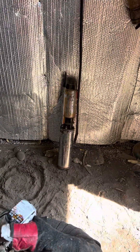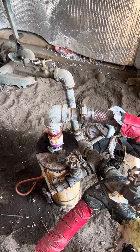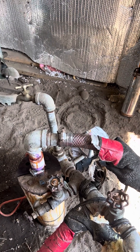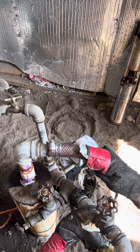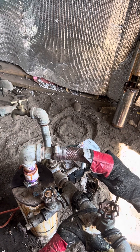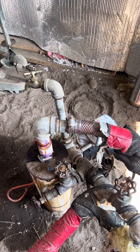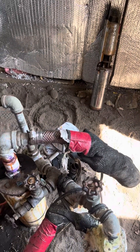There's the pump right there — we pulled it 200 feet up on PVC pipe. We did maintenance on it: checked the line for cracks and breaks, checked the wiring for cracks and breaks, and taped the wire. The guy that put the well in didn't even rope the pump — he didn't have it roped.